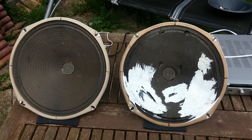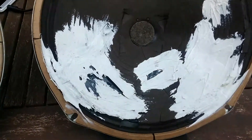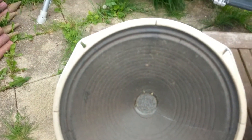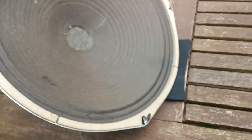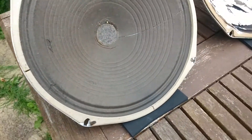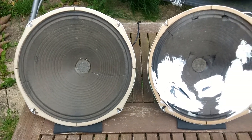This is a Honeydukes video on how to see if your speakers are good. Here are two that are bad. Quick visual inspection — this one has seen better days. This one looks fine, absolutely perfect, except if you look closely you can see the cone is recessed in the basket. That's going to limit movement, which will give terrible sound, and there's a tear in it. But ultimately people will say it looks and sounds all right.